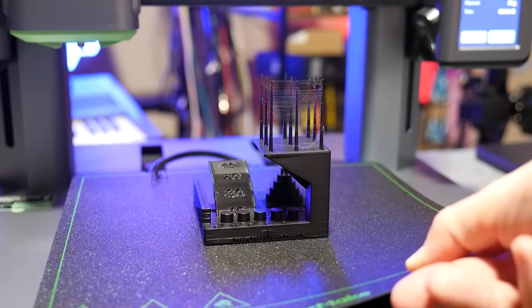I also had to test out a file from the app — this is a little print-in-place corgi that comes away from the print bed with a little bit of wiggle. I couldn't find this file anywhere else; I think it's been made for AnkerMake specifically. It actually printed great and it's designed to print without support material. The line through it is where I actually turned the printer off and then back on — so power recovery does work. It will result in an artifact, as it always does, but it works totally fine.